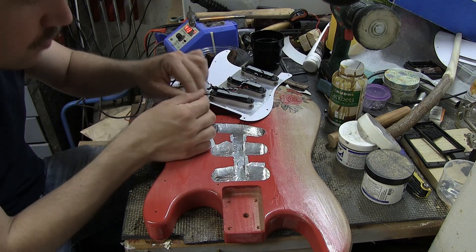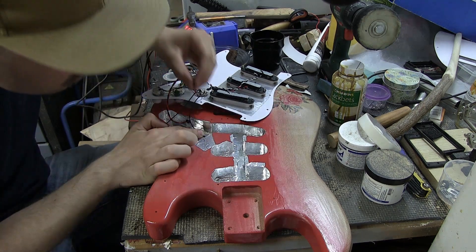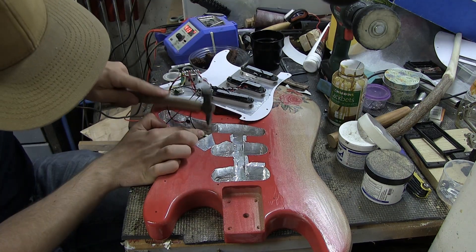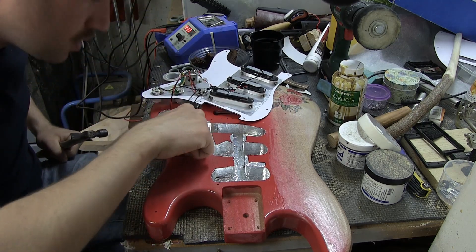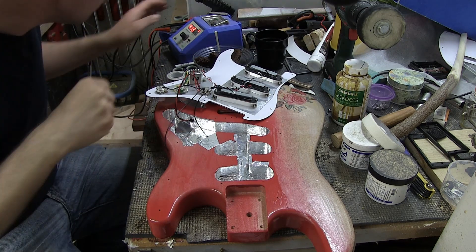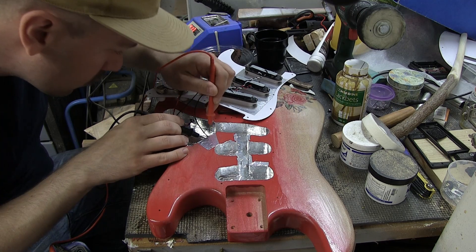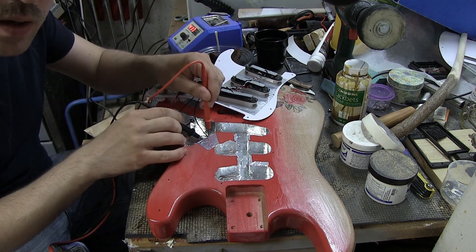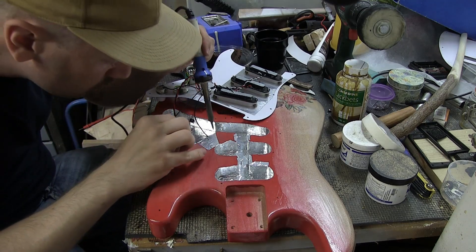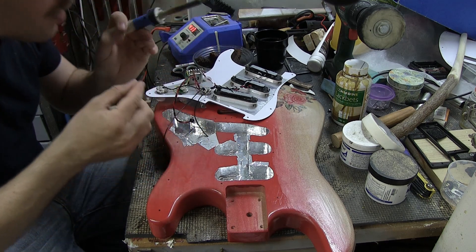It's a little bit confusing with all the ground wires everywhere. This is already pre-tinned and now I can hold it in place. I'm gonna take a little nail — one of those that you use when you make furniture — and poke it into the wood, then take a hammer and use it to pinch the ground wire into the wood. After I've pushed this in and made sure it has a nice connection, I'm gonna take my multimeter on continuity and see if I get a connection to the ground wire — and as you can hear, everything is connected. Just to be on the safe side, I'm gonna melt a tiny bit of solder into where the nail and the wire are being pinched towards the shielding tape, to melt all three points together.